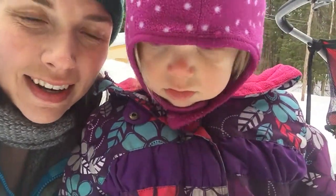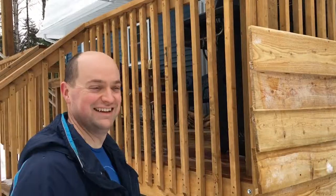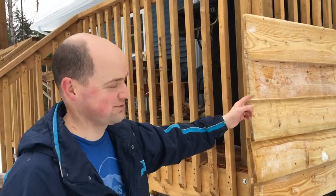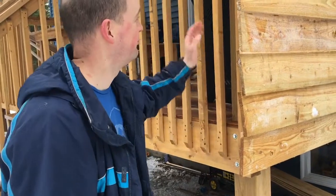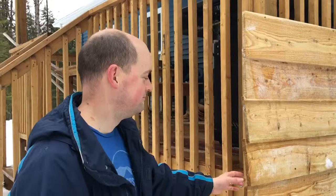Are you saying hello? So you can see here I've left an overhang of a few inches. When I cut the logs for cutting the tree down, I cut them 10.5 feet, knowing this was 10, just so that I have a little extra, and when I'm done, I'll just cut this off with a skill saw, with a circular saw, as some would call it.